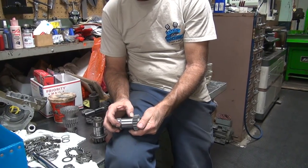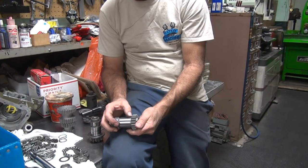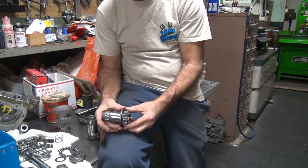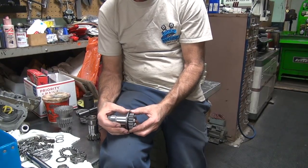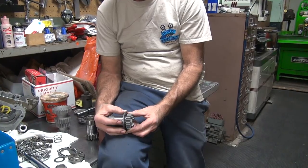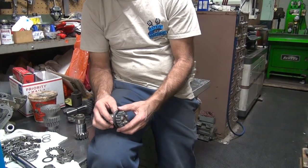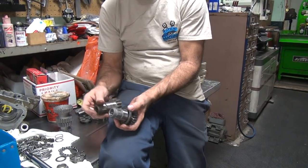Otherwise, I'm going to have to go in here and make a spacer. Like a big Belleville spring. What you need is this here to sit out here further. So we need to make a conical spacer that's 60, 70 thou thick, basically at least. Which would suck that thing forward. You cut this bushing back the same amount, everything sucks in. Like so we're 100, you can go 100 thou, would be nice. But the difference in height over here is not 100 thou.